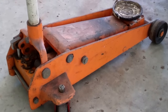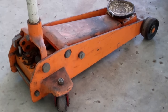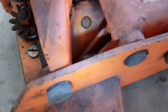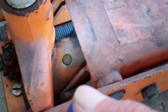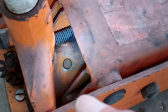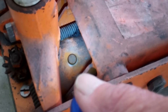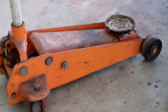Now, if it takes you a lot of pumps to get it started, or if it gets herky-jerky on the way up and down while you're doing that, that's fine — don't fret it. In fact, that's kind of what you're looking for. Once you do that four or five times, come back over here, put it all the way down, open that plug again. When you open that plug, you're probably going to hear the hiss of a little air — that's all the air you just bled out of the system. The system is nothing more than a valve and a passage; you don't have very far to go to bleed one of these things. Bleed it out of there, open it up. You probably won't, but you might need another touch or two of oil. Put the oil back in there, plug it back up. You're good to go. You won't have to touch this thing for probably another ten years or so.